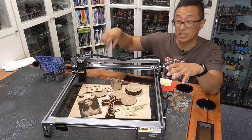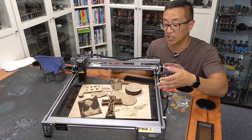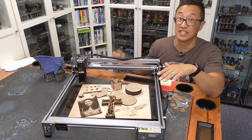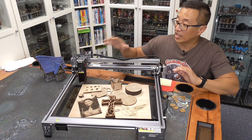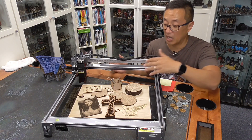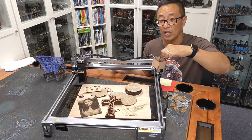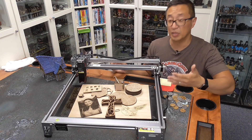I'm surprised at the ability of this tool to cut material. When diode lasers first came out they were around 3 or 5 watts — you could cut material, but maybe 5 passes for even really thin 2.6mm wood. By having higher wattage, you're able to cut thicker and thicker pieces of wood. This proves you can make all the cuts you need, and even this utility box I made to hold the machine's tools was cut relatively easily. I chose to do two passes rather than one just to avoid edge burning, but I'm just impressed at this machine's ability to make cuts.